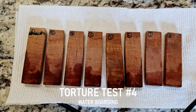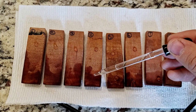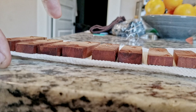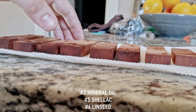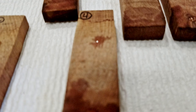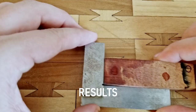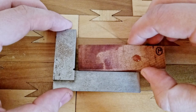Next I'm doing an absorbance test. I let all the samples dry and dropped two drops of water on each piece — one in the test zone and one in the non-test zone. After about five minutes you could tell that a few samples were completely letting the water in while others kept the water on top without absorbing. Numbers three, five, and six — mineral oil, shellac, and linseed — all absorbed really quickly, meaning the finish had completely worn off. After another 10 minutes we got more failures. Interestingly, the control piece didn't absorb much water — I think it was so waterlogged from earlier tests it hadn't fully dried. Number four kind of failed as well. Number two stayed in the running and numbers seven and eight did pretty well.